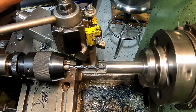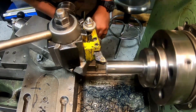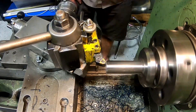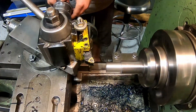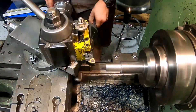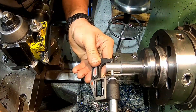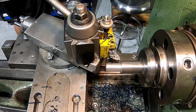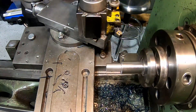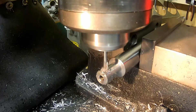When I flipped the shaft I began by facing it down to the dimension I had established. The other side of the shaft was a lot less nerve-wracking because I didn't have to worry about ruining threads — it was just taking the shoulder down to the inner diameter of the pulley, as well as tapping a hole for a retaining screw on the end.